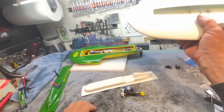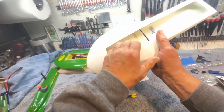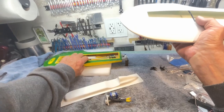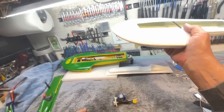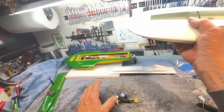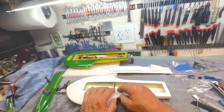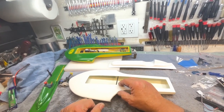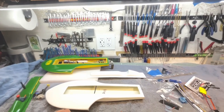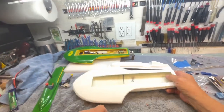So I'm thinking about this boat, and I want to build this one lighter than this one. And already I think I've got a heavier layup than this. So I'm looking at the lightest power system I can get. And the more I think about it, the more I want to go to a small motor, a little tiny motor of ridiculously high kV that'll turn 8,000 RPM whilst drawing 18 amps. And so I'm thinking a really tiny motor drawing about 18 amps.